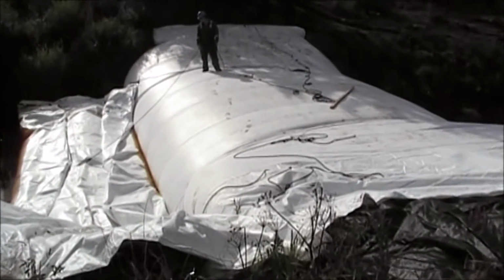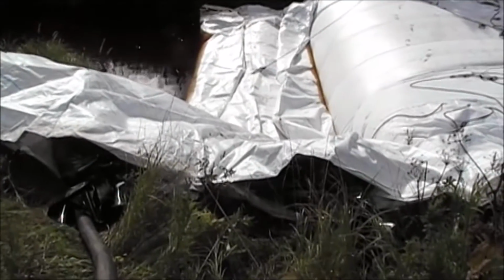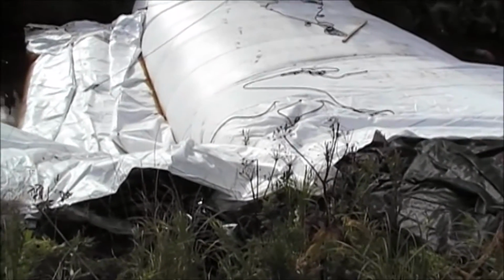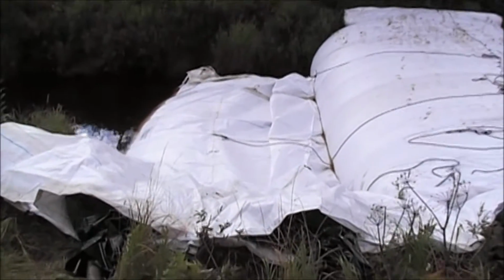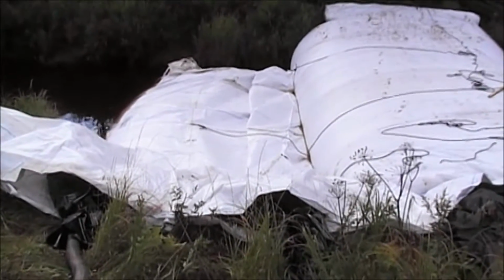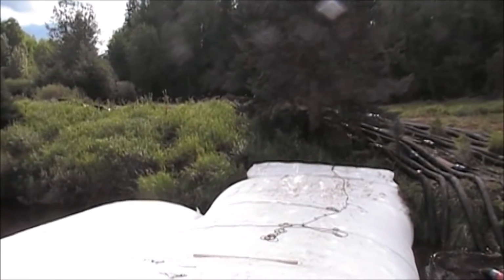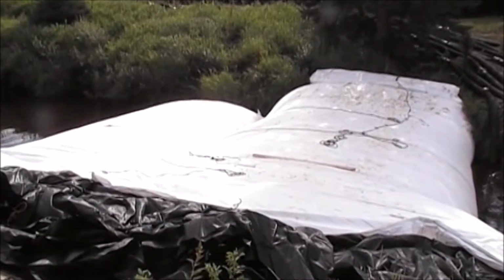The 12-foot high dam took approximately an hour and a half to install. Yes. Using 2 4-inch pumps, electric. Ten minutes later, the 12-foot and 8-foot high AquaDams have both been put in. We're moving on to the downstream side AquaDam. The pumps are keeping up with the flow very nicely.